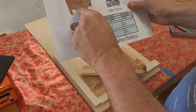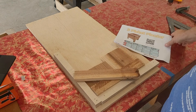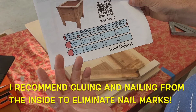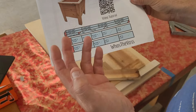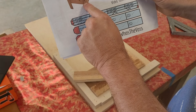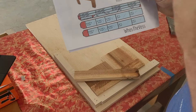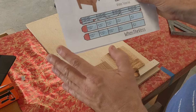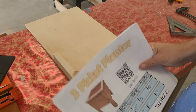To install the shelf brackets, cut the pieces to the final width and then glue and nail those along the bottom edge of the planter box. You'll also find this makes it a lot easier to install the shelf pieces rather than trying to align them with the bottom of the planter box and eyeball it while nailing in place. Using shelf brackets eliminates extra nail marks on the outside of the planter box and makes for a better looking finished product. So: make shelf brackets.